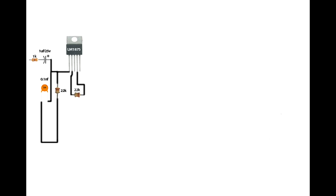Now build the subwoofer circuit. Set up an LM1875 IC. Connect a 22 kilo-ohm resistor on IC first pin and ground. Connect a 104 ceramic capacitor between IC first pin and ground. Connect a 1uF capacitor positive pin on IC first pin. Connect a 1 kilo-ohm resistor on the 1uF capacitor negative pin. Connect a 22 kilo-ohm resistor on IC second pin and fourth pin.